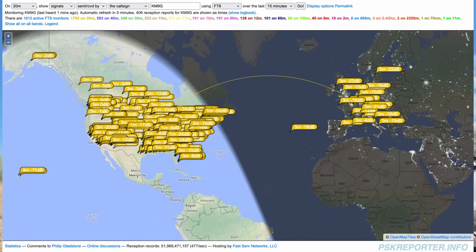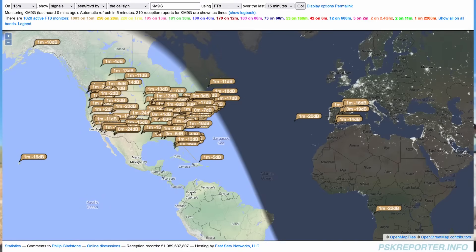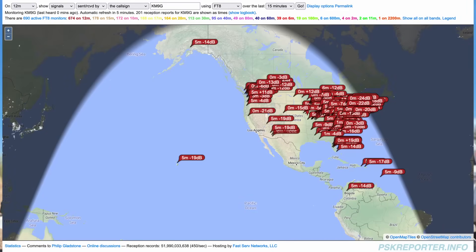Here's what the map looks like on that — still a little finicky though; every so often it just gets that way. This is 15 meters at 100 watts — I was fighting the RFI back into the 705. I had to shut everything down, start everything up again; got the choke on the coax, got the choke on the USB. It's just the way it is sometimes with this radio. But the map looks pretty good — I'm getting lots and lots of distance out of this thing. 12-meter band at 10 watts — anything that is zero or one minutes old is at 10 watts, and anything four minutes and older is at around 80 to 90 watts.